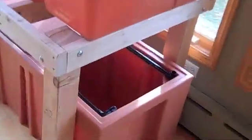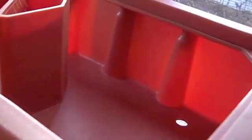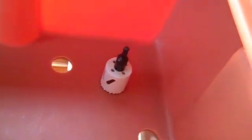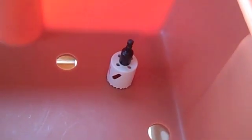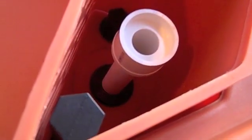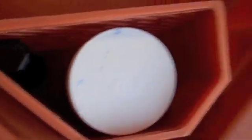What I have left to do now is core drill through the grow bed so I can fit the bell siphon bulkhead fitting through the floor of the bed. All right, so I've got all the plumbing hooked up — the hole is drilled for the siphon. There's a stand pipe for a drain just in case, an input into the grow bed from the pump, and in the middle is the auto siphon with a big cover over it. All the plumbing underneath is hooked up as well.